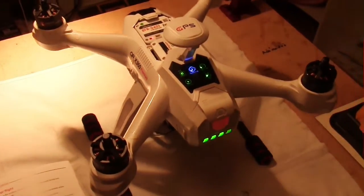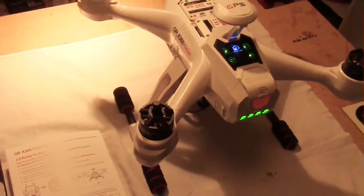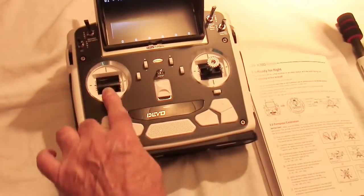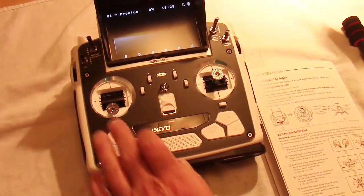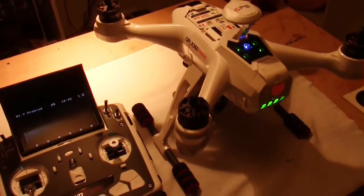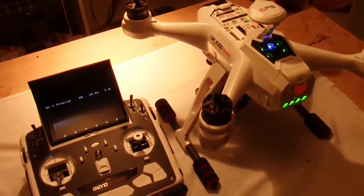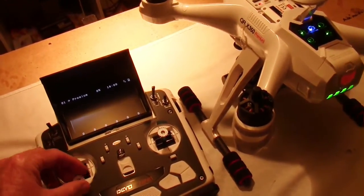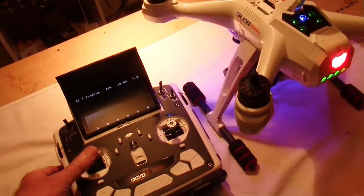Okay, we went through the binding process again. In other words, we shut it off and then rebound after the calibration was done, and now the motors can be run by unlocking them. So not running yet. You have to unlock them, and now we're ready to go. So if you don't move the throttle and there's no activity, after about 10 seconds or so, the motors will go back into lock mode. So now it won't spin anymore. And to unlock it, you have to move the stick back over and hold it down. And then you can run again.